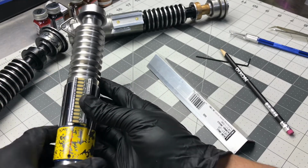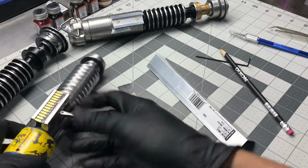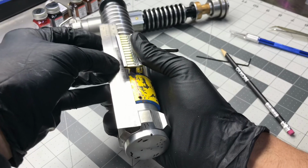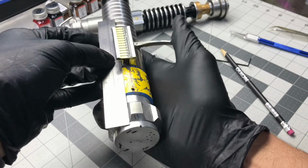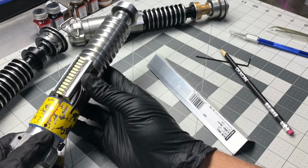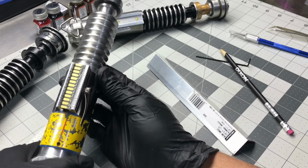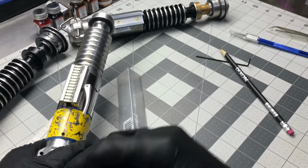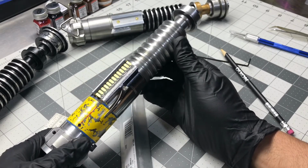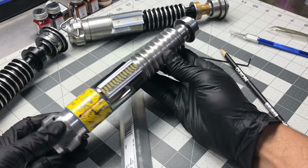So that's my tricks to lining up the clamp. That's my tricks to lining up the stencils. Number 2 stencil is pretty important. I see a lot of people talking online about how it's not lining up, but if you do these steps, it should line up no problem. Another thing is, don't rush anything. What's the big rush? Just double check everything like we just did tonight. I put it in my angle iron, made my lines, went over to the door frame, double checked it. Yep, went to the door, perfect. Don't rush. I hope this helps you guys out.